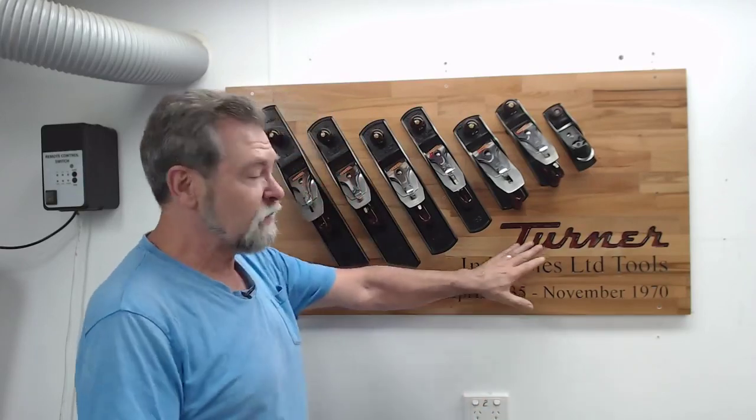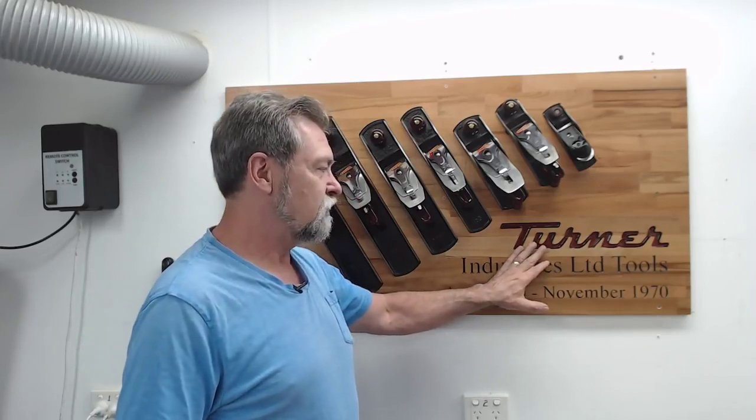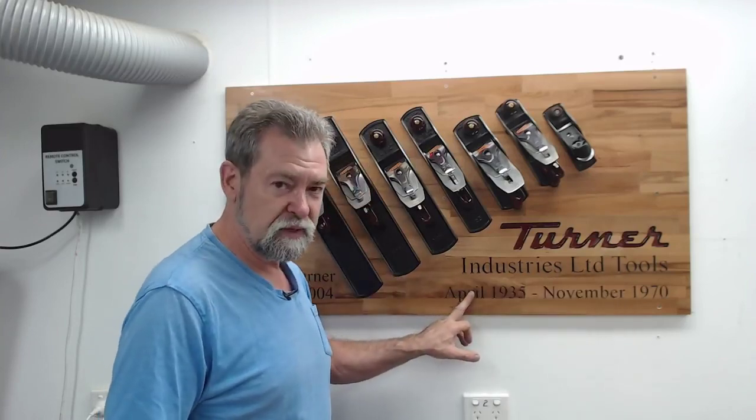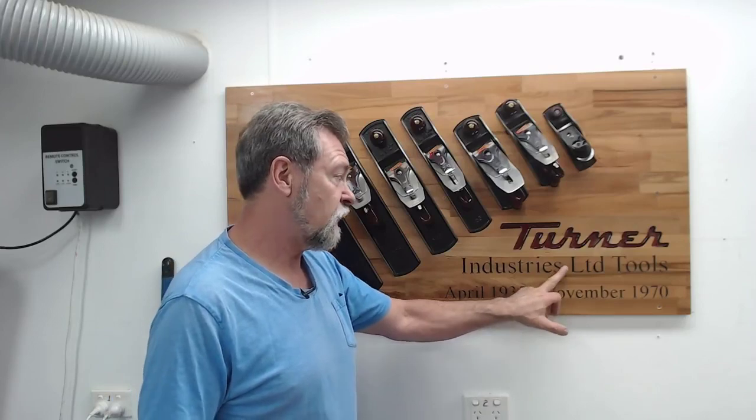Now, Aspire also has the capacity of creating a vector from an image, but it's not as sharp. This is an old cardboard box, and it was furry around the edges, around the text, and I was having a bit of a time trying to get it really clean. Deep etching is just a way of tracing a line around the image in Photoshop and then converting it into a path, little marching ants. Anyway, you may not be interested in that. So that's how I did that. And this was just with the V-carve, with a V-bit, using V-carve in Aspire.